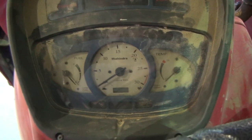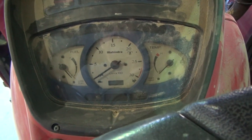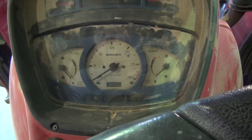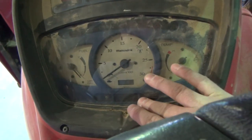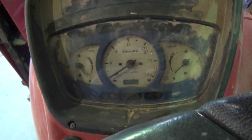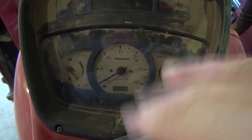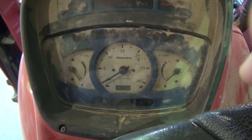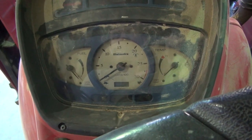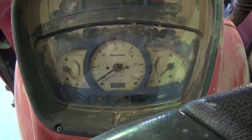When I start this tractor up, I'll show you how I got it set. The battery light will likely come on because it is idling at a lower RPM and the grid heater is cool outside, so the grid heater light will come on right here. Whenever I bump the throttle up a little bit, the battery light will go back off. The older tractors and older vehicles with a GM one-wire alternator used to do this as well — that's just the way the alternator functions on them.